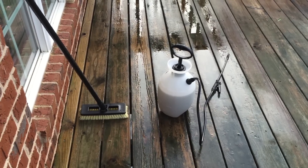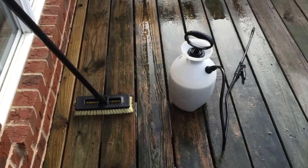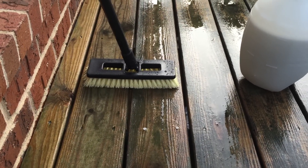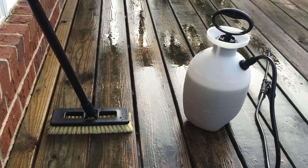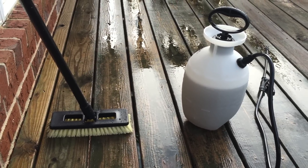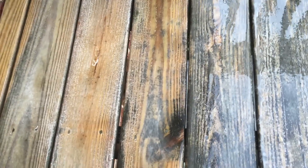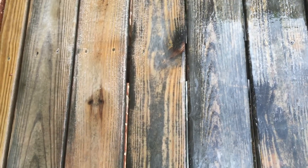We got a hard rain this afternoon so I didn't get to this part of the project as quickly as I thought, but I'm going to be using step one of the Restore-a-Deck system. I've already mixed it — two-thirds of a cup of the powder to a gallon of water in my pump sprayer. I picked up a swiveling deck scrub brush from the local hardware store. It says to spray this on, wait 15 minutes, then scrub with a scrub brush and spray it off. I'm going to do five boards at a time since that's how much I'll be able to get done. I applied the cleaner pretty liberally to the first five boards and you can already see some foaming. We're going to give it 15 minutes and come back. After 15 minutes it appears that all the bubbling is gone and we're going to scrub and see what comes off.